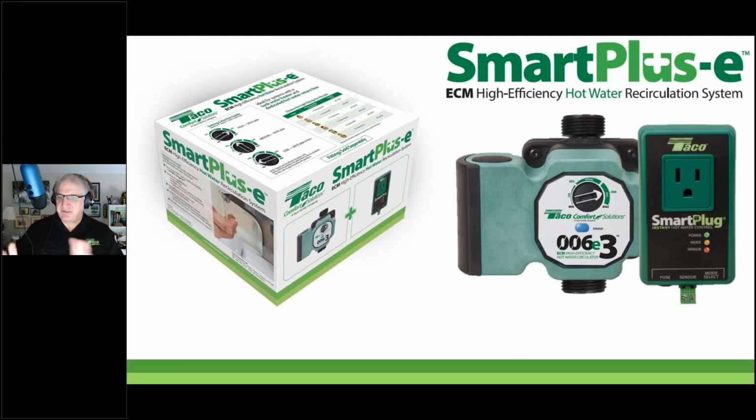But you get the fittings, you get this package, and if you have a recirc line, bam, this is a great way to go because you have the flexibility and adjustability of the 006E3, so you can set it up to just the right speed for the size of the system, and watch that 1.6 or 1.4 or 1.2 gallons per minute. All right, so you've got that, and then you have the smart plug for the intelligent control. So you've got yourself covered in both directions, and this comes in one package, if you will.